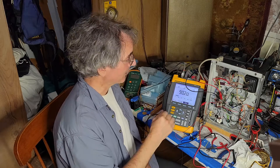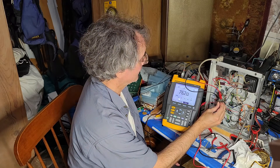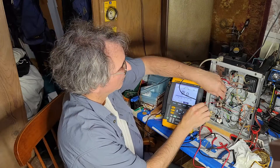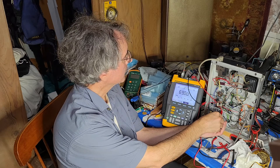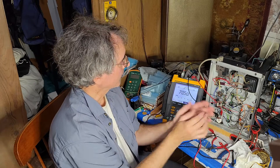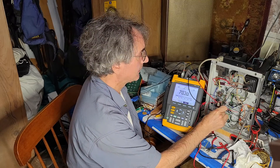So I just did 90 ohms, now I'm going to do 70 — just got to ease this down a bit. These are less than one-turn pots, so they're pretty touchy. Okay, 70 ohms. And now for the other channel. It's real touchy in this range — of course, these are very old pots. I would never use these in a final build, but they're nice to have around for testing purposes. Alright, 70 ohms.